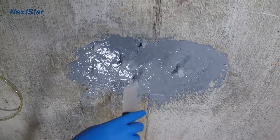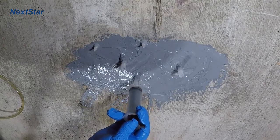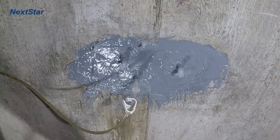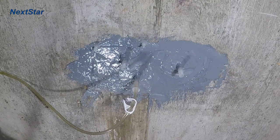If it was epoxy, we wouldn't pre-wet it. So we'll just put it in the bottle on here. This particular spall was a leaker. Proceed to inject it with polyurethane. Let's see it go in — we're just going to pump it until we see it coming.